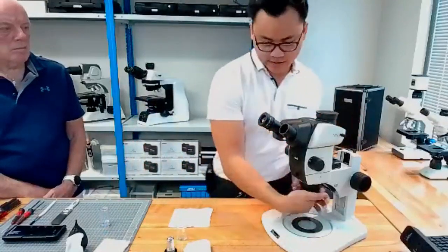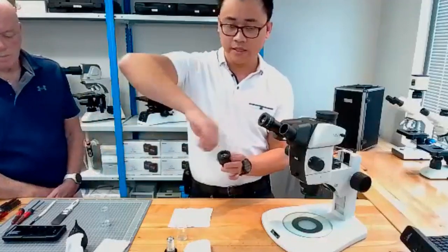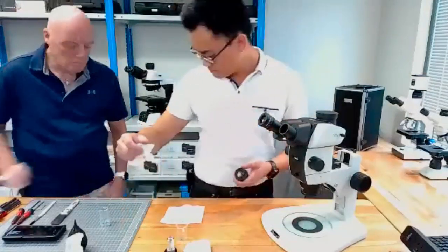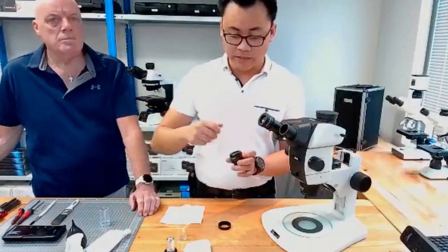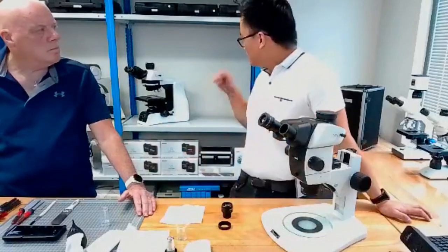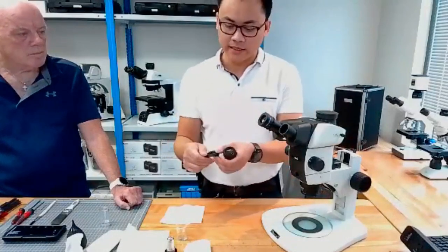That's pretty much all you have to do for stereo microscopes — the same procedure applies for eyepieces with that wiping and picking-up motion. You can go around the edges as well. You can use cloths for drying — do your initial wipe and clean, and if you still have residue, wipe it off with a cloth. Also remove the eye cup before cleaning because dirt and debris will build up in there over time, and if you don't, you'll just keep finding more and more dirt.